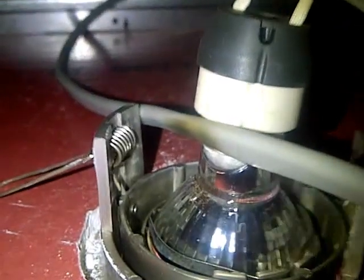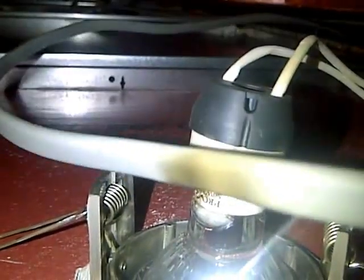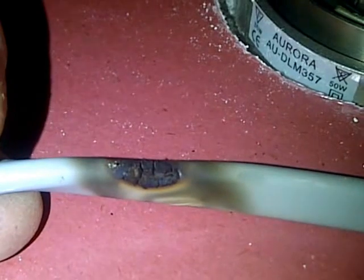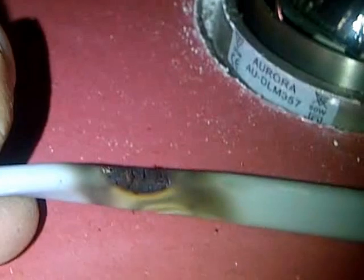As you can see, the cables are burnt. I was just highlighting the dangers when installing down like this. There you go — you can see where the cable is almost burnt through. We just have to cut that back and put a junction box on there.